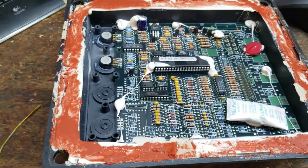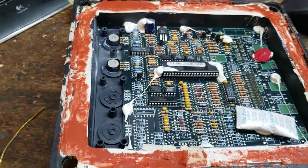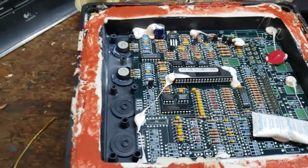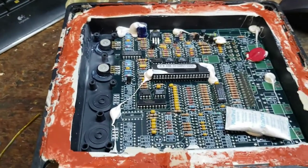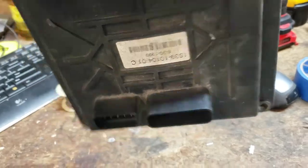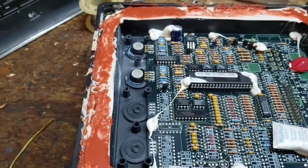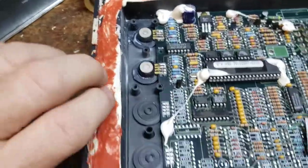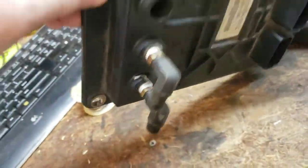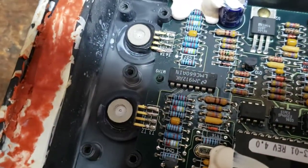All right, real quick little instructional vlog on correcting the air pressure gauge issue in your diesel pusher. This is the VDC unit. It has air lines and data connections, and the connections feed the gauges in the dash. And what the problem is, these air lines have electrical connections to them to detect air pressure.